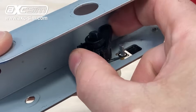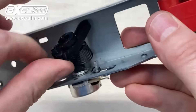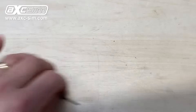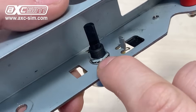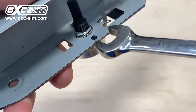That allows you to remove the gear and the spring. Then the potentiometer is held in with an 11 millimeter nut — or the same as 7/16 of an inch.